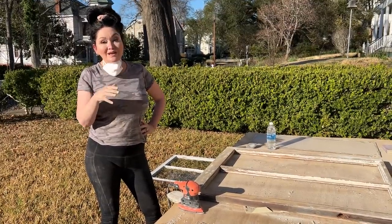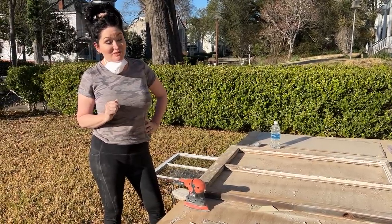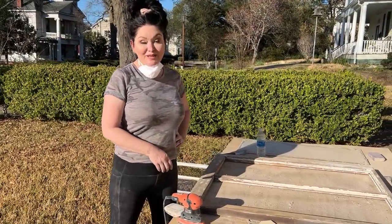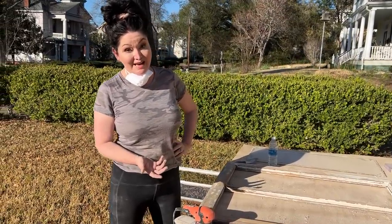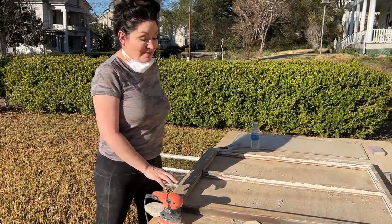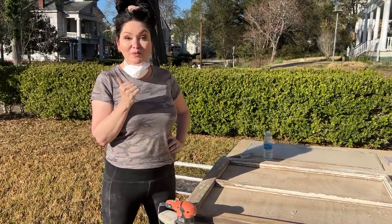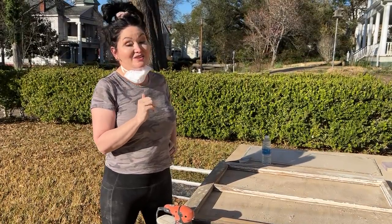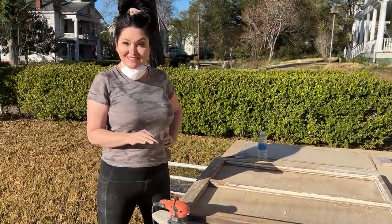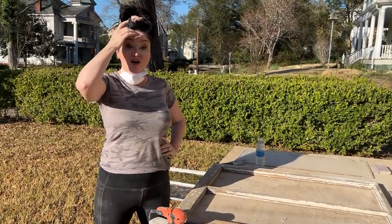In the middle of window repair. Don't replace your historic windows. We've talked about it before. Amazingly enough, on the interior of these windows, we didn't have lead paint. We think it's because they'd only been painted one time sometime in the 80s. So we've just got the latex paint and then the original finish underneath. So I started out by removing the windows from their interior sash, got all the original glass out safely. I'm now stripping all that latex paint off.